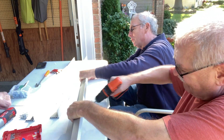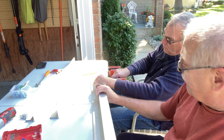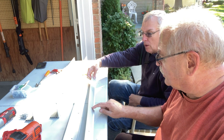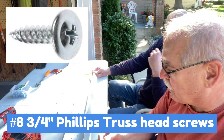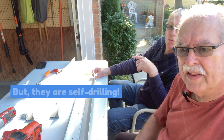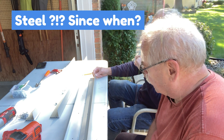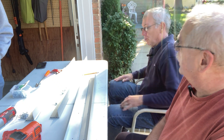The PVC strip is right at the bottom of the door, so I can't move the PVC up. This piece is going to go on the outside of the door so the door will be in here on the bottom. I want to drill some holes in here — the original piece already had some holes in them and we use those as a guide to put holes in the front faces. We've got five pretty clean holes. We're going to use these screws — number eight by three-quarters inch long — and those almost fit in there, so that'll be good. These are not self-drilling, but that aluminum's pretty thin, so we're hoping that tip is just going to poke through. We hold it flush with the end of the door and drive the screw in — be careful not to strip it out.